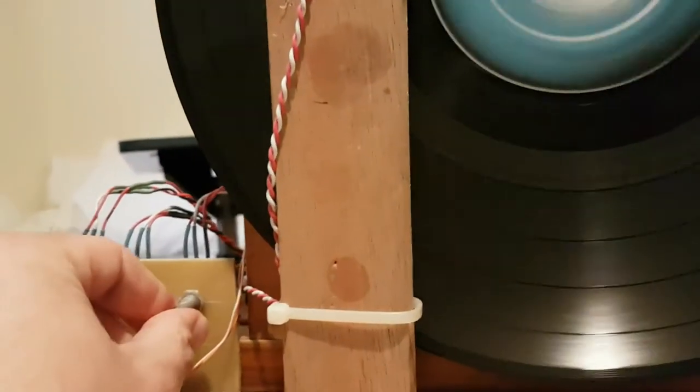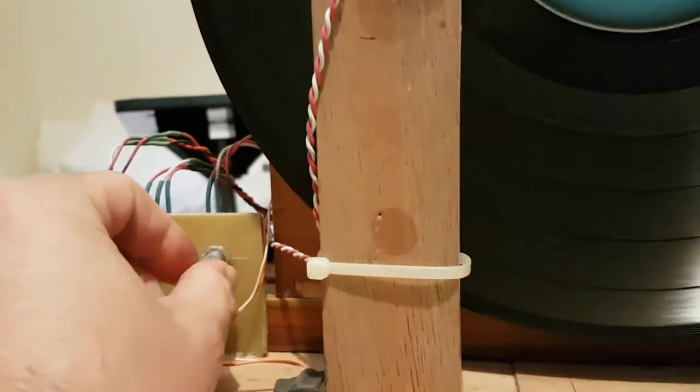You can see the picture but very skewed. What I'll have to do is boost the DC motor, get it functioning faster, then turn it off and it should hopefully synchronize, but it ain't. So it's a bit of a fiddle process. I'll have to probably make some adjustments to the synchronization dial here. So I have to boost it up. It also has to be in alignment because it can be off-centered. Okay, it looks like it's trying to synchronize itself. There we go. It's synchronized.